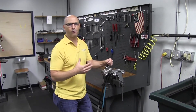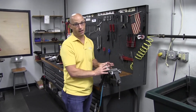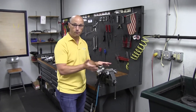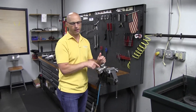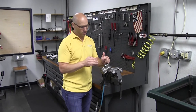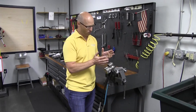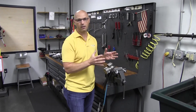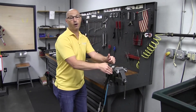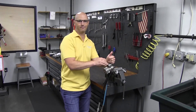When considering a hydraulic torque wrench from any manufacturer, make sure the housing is machined from billet. This is where we put 10,000 PSI — that pressure goes behind the piston and moves it forward and backward. We're not even at high pressure right now and you can see the leak. At full pressure, this would become a high-pressure spray that could inject into your hand. When choosing a hydraulic wrench, go for ones machined from billet, like a Torque Up tool. All our TU and TX tools are machined straight from aircraft quality aluminum and aircraft quality alloy steels — never cast. Take care.